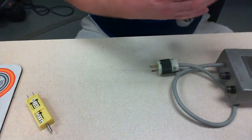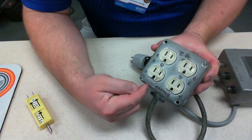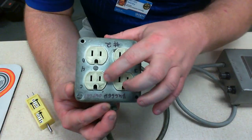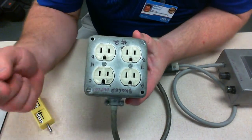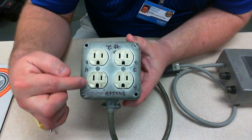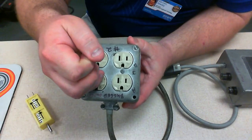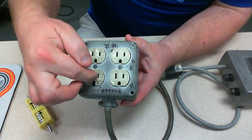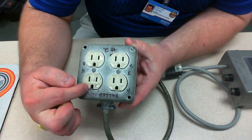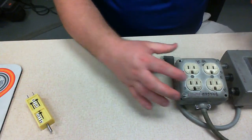Another good example of something we look for — and this is very subtle — is one of these plugs is actually damaged. It's this one right here, and I'll show you why it's damaged. If you look at the ground pins in here, each one of these ground pins has a little ceramic bar in there, but not this one — it's been snapped off. What happened is somebody, when they ripped on something, twisted it and it actually damaged the inside of this port. These are some of the things we would look at outside of the obvious burning and charring, and this is what we would turn into an electrician to have them repair.